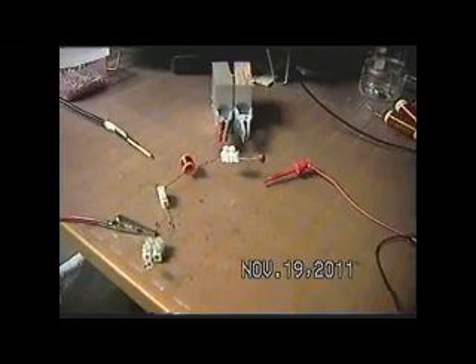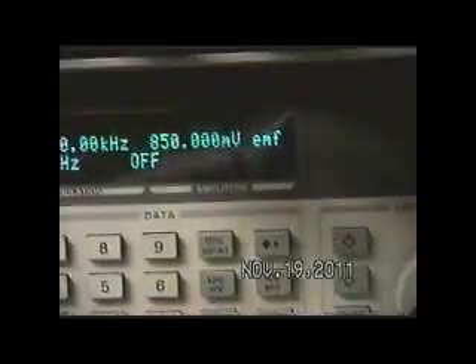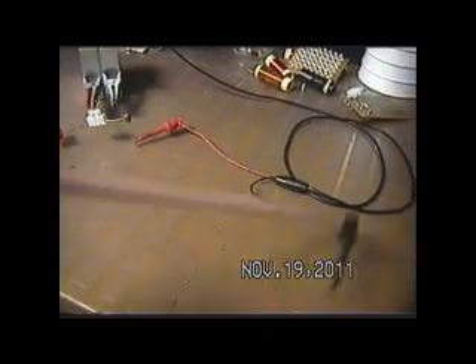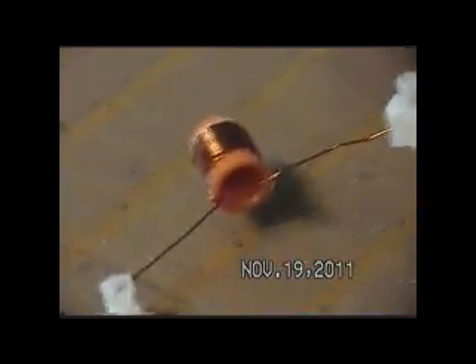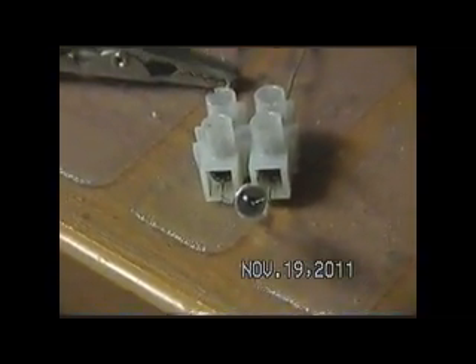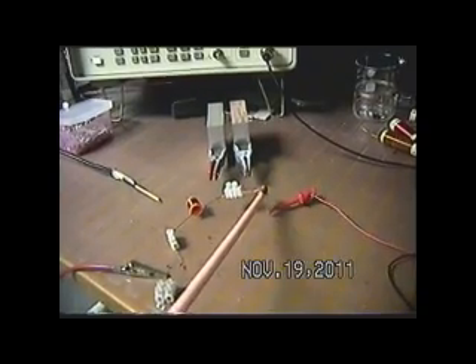Now I've done nothing to my signal generator. We're still running 44 megahertz, 850 millivolts, and there's the single lead. You can see the lead coming out of the generator, single leaded — going into this NPO 10 picofarad — it's connecting to the 92 megahertz coil, going into the AV plug. But guess what? We don't have any signal. We don't see one iota of light coming out of that LED. So, is 10 picofarads 10 picofarads? Why should it make a difference if we have 10 picofarads of capacity through two large masses versus 10 picofarads of capacity in this small little NPO capacitor?